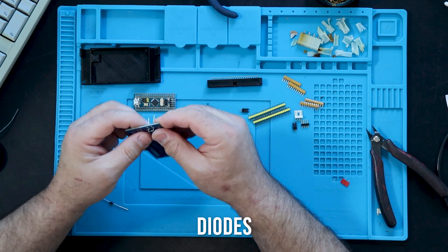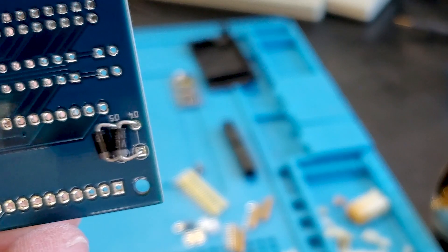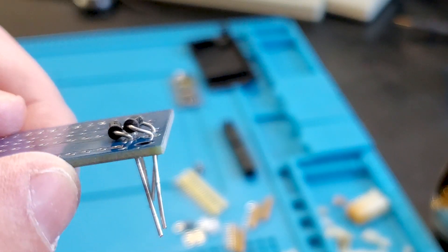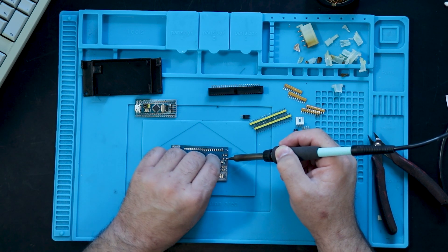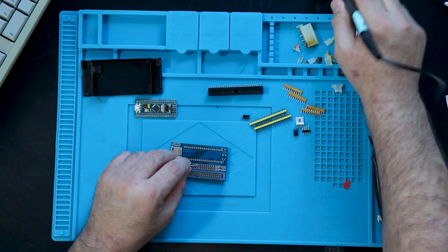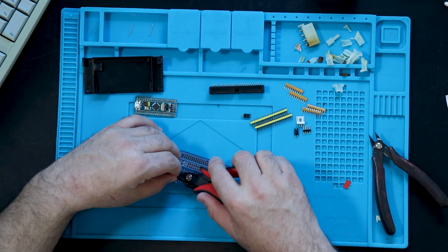Now it's time to complete the soldering. Install the remaining parts in the following order. Install the two diodes on the back side of the board with the stripes towards the closer edge. If you have an older board, you're going to have to carefully bend the leads in so that it'll fit — get them in and down close to the board without shorting against each other. When snipping off the excess leads, you need to wear eye protection. I like to use one finger to hold the lead in place while I snip it to keep it from flying away — it's amazing how fast and far these things can fly when you cut them off.